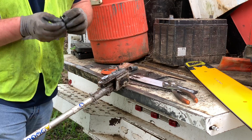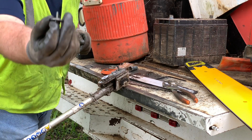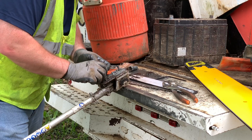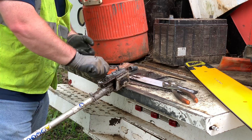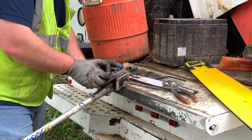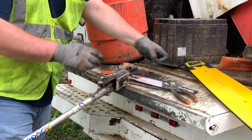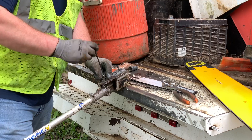It's supposed to be flush — I know y'all can't see that on the camera, but it's supposed to be flush, kind of like how that is. I'm going to take that one off. That was why it was kind of more difficult to get the screw down in there or off of it. It was one of those washers that were kind of oblonged out.